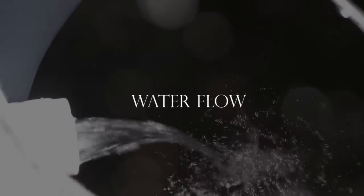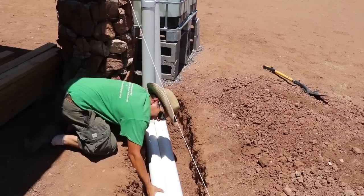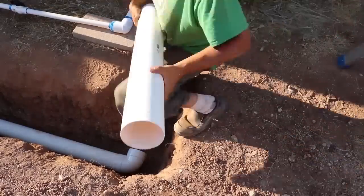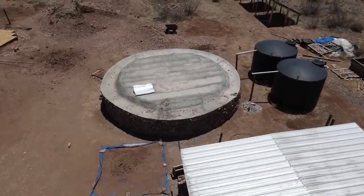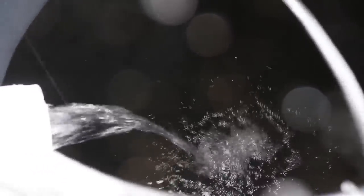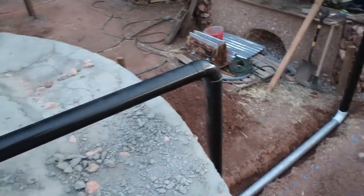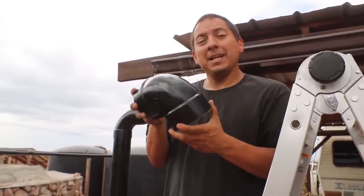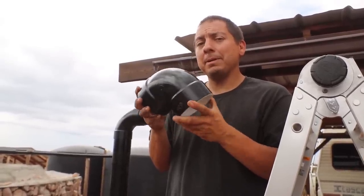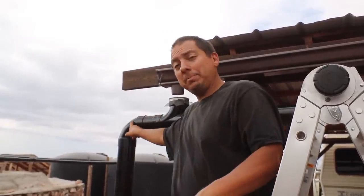In a previous version of this system I had to get water from our roof over to our poly tanks, and I tried doing a wet system, but I had so many 90-degree angles — seven of them — and combined with the lack of drop between the roof and the poly tanks, the water just didn't have the right flow. It was going into the poly tanks but not fast enough, causing backup at the roof. This new setup has five 90-degree angles, which I think will be okay.